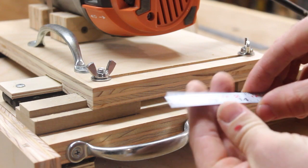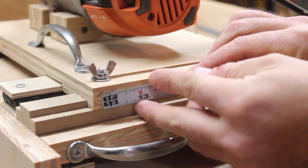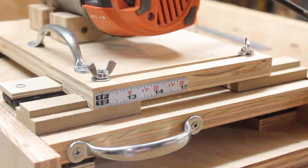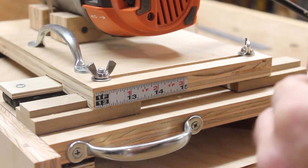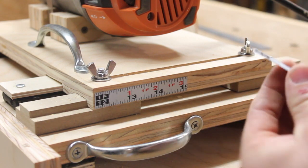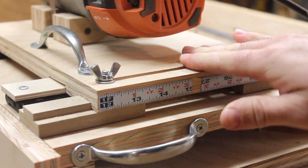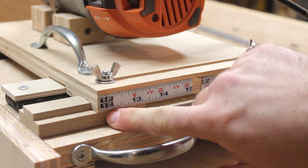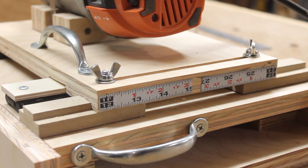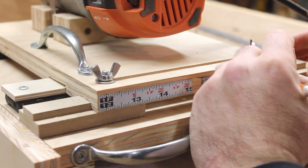Alright, so I just cut a section of the measuring tape at the 12, 13, and 14 inch mark. This side here is actually going to end up being upside down because the measuring tape only reads from left to right — but that's okay. Now I still have the router at dead center so I can make two reference marks: one at the 12 inch mark on this stop lock and one at the 24 inch mark on this stop lock. And I'm just going to pencil these reference lines in so we can easily change them if it has to be calibrated later.